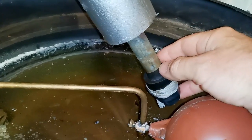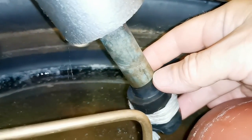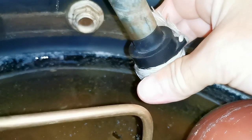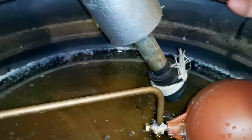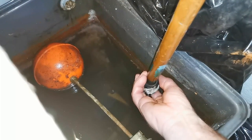I'm just going to put my plug or bung up inside the pipe there. Do be really careful because these pipes can be really sharp — if it's been cut with a pipe slice you're going to tear your bung to pieces, so just be careful you're not damaging your bung. The other way to do it is with a push fit cap. So that pipe is now bunged up — you can see that's the open vent pipe coming down there and vanishing behind all the stuff in the loft.